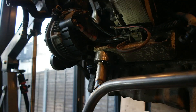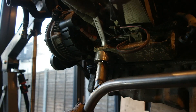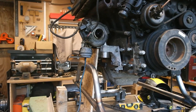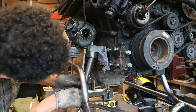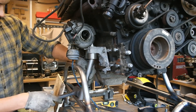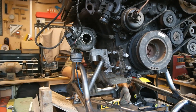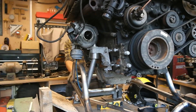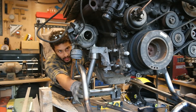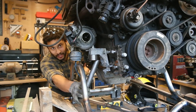I'm going to center the frame up and get a tack on that as well. I'll just loosen off that nut — I'm happy with where it is — loosen it off in case there's a bit of movement when I'm trying to position the other side; I don't want to break those tacks. All I'm doing now is just trying to align this thing, get it centered up, and get a tack weld on that new mount. As you can see it's very difficult to do with one man.